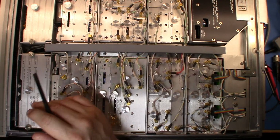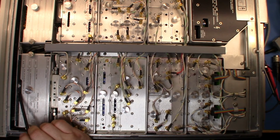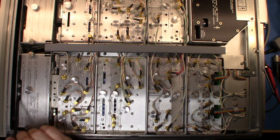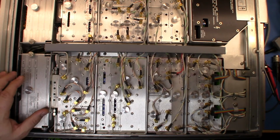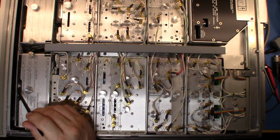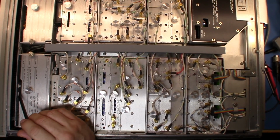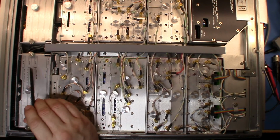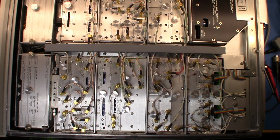So over here at the front, we have the microprocessors and the control capability. You can see where I set the HP-IB address in here. I don't know if that's a fixed address. A lot of the units of this age were transitioning from actual switched addresses to software addresses. So like in the 8673, you could flick a little micro switch that would let you reset the address from the front panel. Earlier products like the 8672A, you actually had to flick the individual switches, I think.